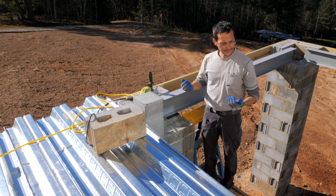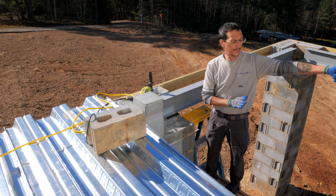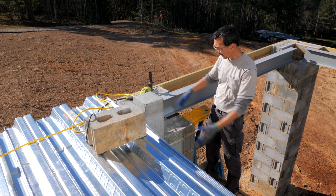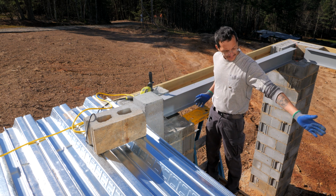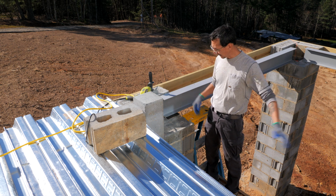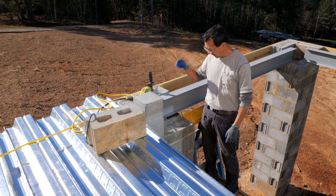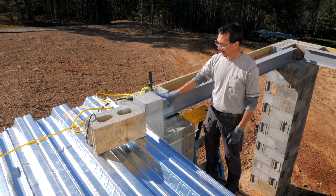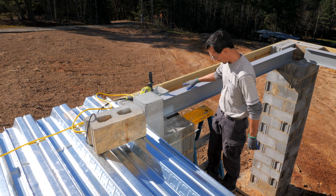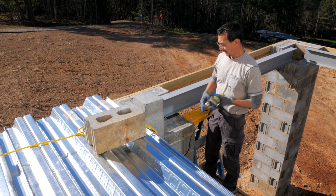I'm about to the end of the front porch where the transition needs to happen, so we rotate the deck pan this way. We'll start going that way for the deck. To do that, I got to put that piece of angle iron right here. So I'm going to set this block here, cut a slit in the brick ledge, lay the angle into the slit, and bolt the other end to the block, giving me a surface that I can bear this deck pan on. First, I'm going to drill two holes, put a couple lengths of rebar in. Then we have to mix up some mortar and set this block on it. Epoxy, get it all, let it sit for a while, let it get rock solid. So first, I'm going to drill some holes for the rebar.